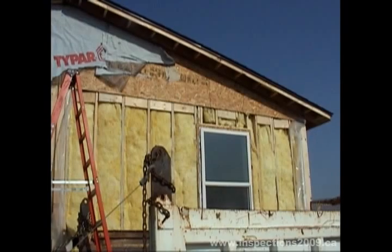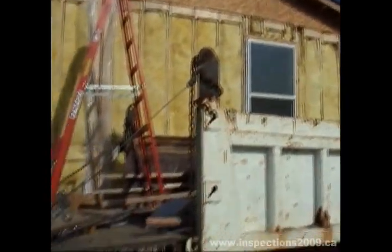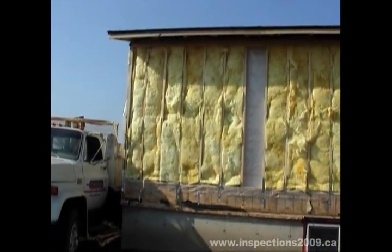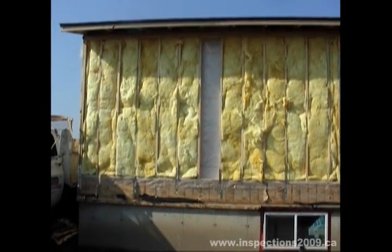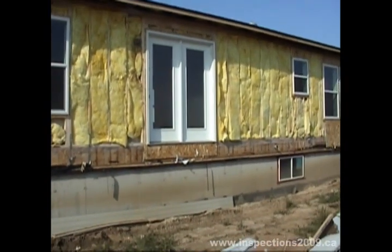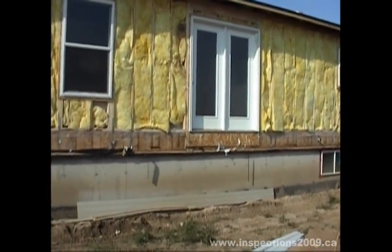September 2nd, Zaharias house — more footage on improperly installed insulation over top of the windows. That centerpiece of insulation fell out when the wall was removed; the 2x6 was not nailed. Everything else is true to how it was when the plywood was removed. The bottom hole by the patio doors is the same way too.